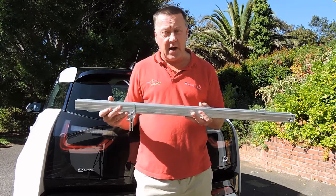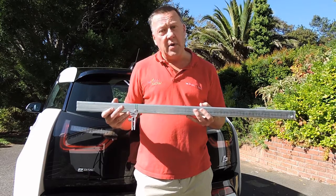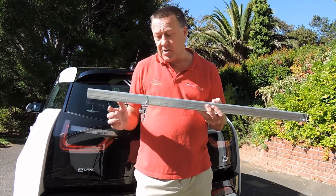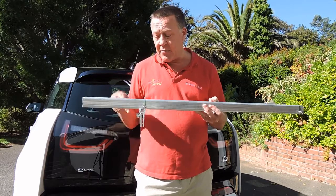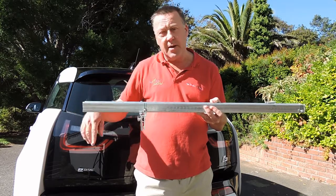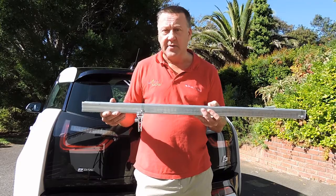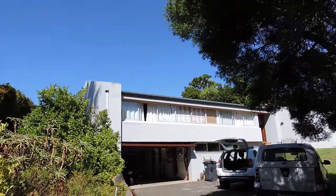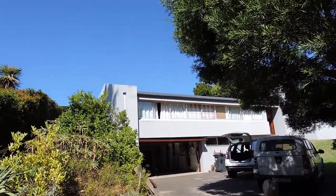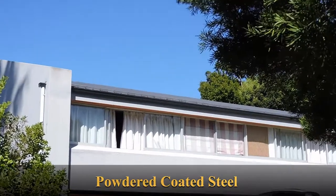This particular home has very high north winds in the winter, so we have actually doubled up the amount of aluminium fixing clips to ensure this is a really solid structure. We mounted these at the points where they fixed to the actual timber structure underneath the roof at regular intervals. It's a north-facing roof at a perfect angle — a steel coated roof — and special brackets are used for the mounting.